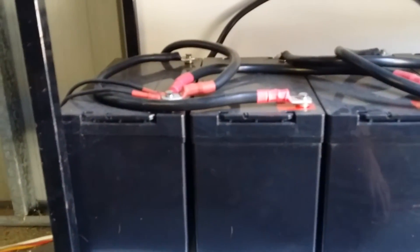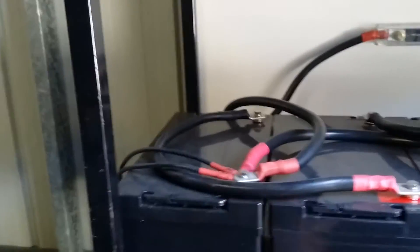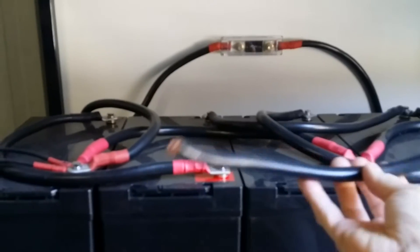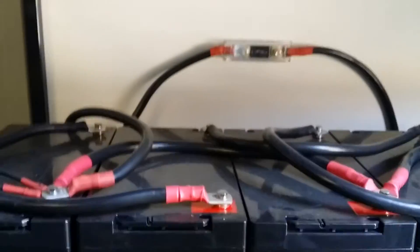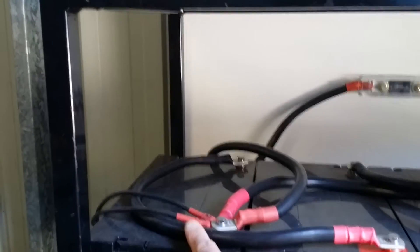The first thing is the batteries. These are eight 12-volt batteries configured in a 24-volt bank — I run them series and parallel to make a 24-volt system. I've used double-O gauge wire to connect them all together, which I learned from just-in-case on YouTube. You use nice thick gauge wire so you're getting a nice charge across all batteries, and you connect your inverter or charge controllers from one end on the positive and from the other end on the negative side, so it all charges and discharges nice and evenly.